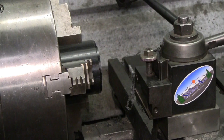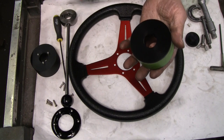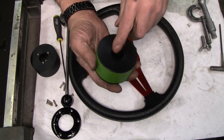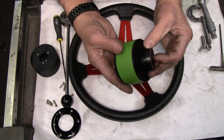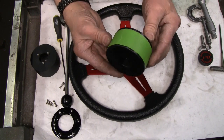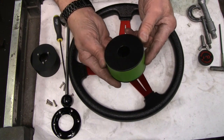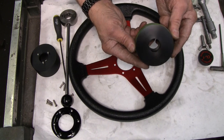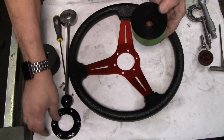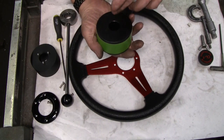It's a lot more fun parting Delrin than it is parting steel. While I was at the small lathe facing and chamfering the back, I did the little counterbore that I forgot about for the hubcap — I got a nice fit on that. We've got this wrapped in some layers of green tape to prevent jaw marks. Now we'll take this to the milling machine, put it on the rotary table, and put a pattern of six holes on this face for the retaining screws for the collar, and two holes on this face for the dowel pins.